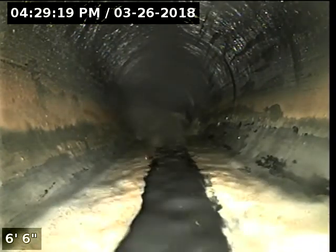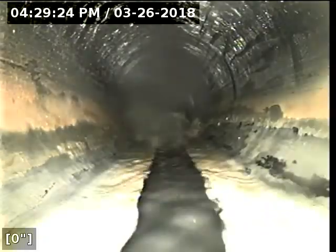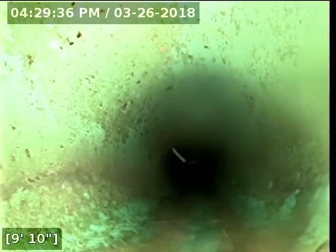Getting my camera down facing downstream. There's some sludge — there we go. We're in four-inch ABS. I'm going to zero out my counter and begin the scope. Notice there is some sludge buildup. At 10 feet...